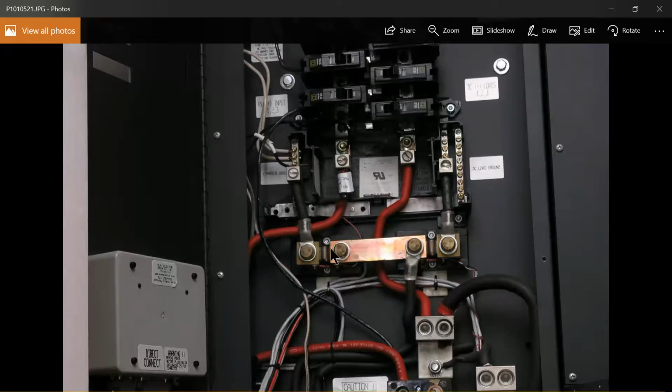That's the final connection. Actually, if you were going to maybe leave these shunts in play, and it's possible you could leave the Bobier Omnimeter powered up and still get some additional metering out of it, perhaps. We'd have to think about that a little more. But then here's where your battery negative would be, I'm talking about the battery negative connection in the Midnite Solar charge controller would be to this lug right here.